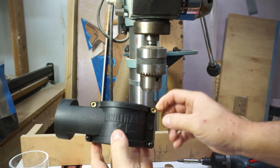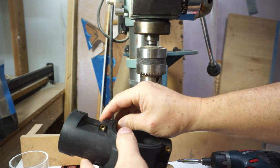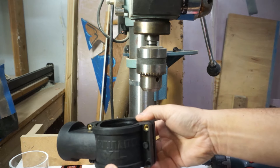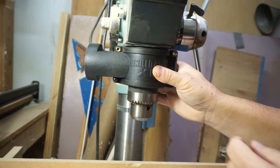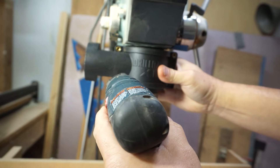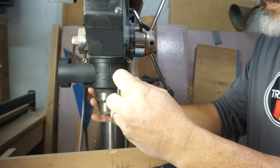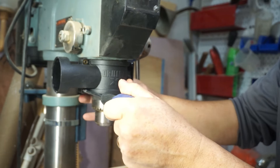With the bushings removed, I'd suggest loosening the two screws closest to the dust port — you don't have to take them completely out, just loosen them so you have some play. I would recommend removing the screws on the other side, which we'll call the front, so you have a little more room to open it up. Then all you need to do is slide it up onto your quill. Once the adapter is up there, squeeze it tight and snug the screws just enough so it holds. Do the two front ones first, then get the back ones on easier. Finish up with a hand screwdriver so you don't strip anything out — just go along and hit all the screws, get it adjusted just right.